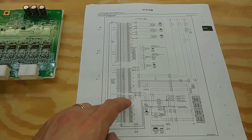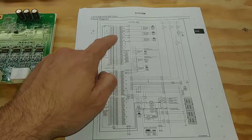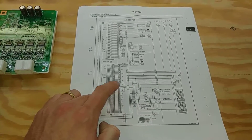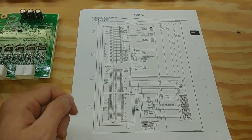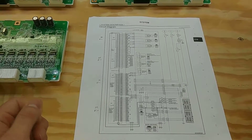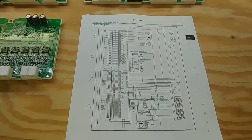If we didn't do that, LIN bus communication — it's a serial chain, signals propagate from one chip to the next — the unpowered chips won't pass the signal through. It's like Christmas tree lights: one bulb goes out, the whole string dies. So if one chip is not powered, the whole string goes down.